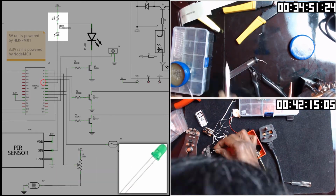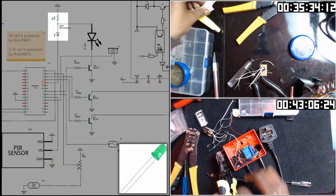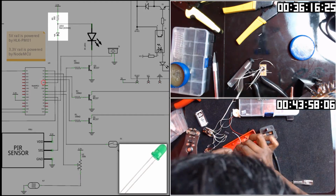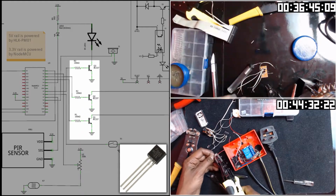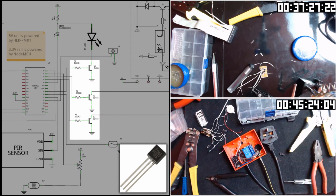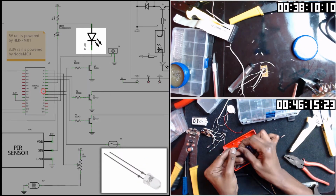I'm using a small green LED as visual indicator going to D4 that would blink depending on current state. As both this and the IR LED run on a lower voltage, I have used a 1K resistor just to be safe. For the next two components, I have used a generic NPN transistor only as a driver. There will be some more information about this later on and how it might be possible for you to skip it. IR driver is hooked to pin D5.